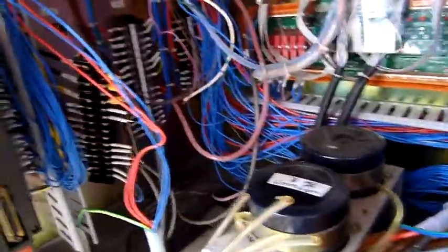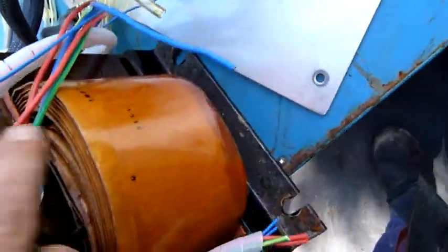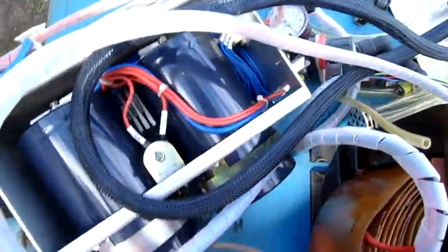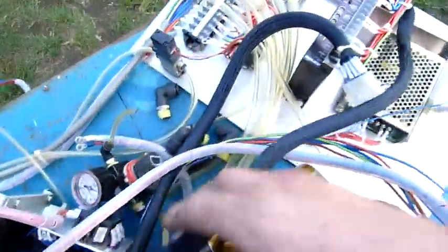I'm going to start cutting cables and just ripping stuff out. There's good wire in it, but I've got rolls and rolls of brand new stuff, so I'm just going to sever all these cables and throw them out. The boards and things we'll look at later. This is a 100 volt 3KVA transformer - could be quite handy. Also got capacitors to go with it, which are apparently rectified - there's a bridge rectifier down there. So 100 volts DC with some decent - I think they're about 10,000 microfarad 250 volt caps. Serious stuff.